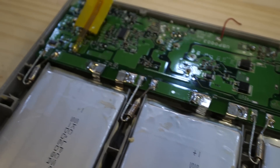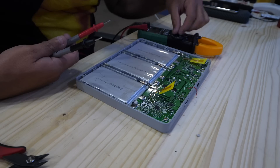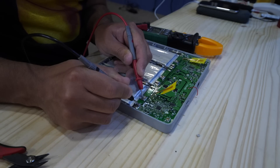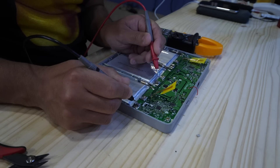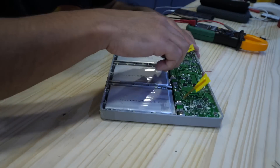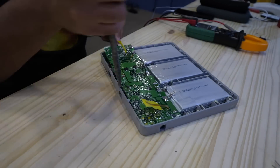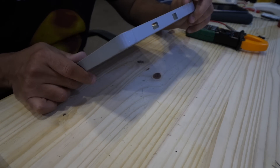At this point I decided there's not much useful stuff inside — there's a huge circuit board that doesn't do much more than adjust 11.1 volts to 20 volts and everything in between. Since it's bricked and I couldn't get it to work, I thought let's just take the cells out — unglue those LiPo cells and figure out how to use them. There's not much else to do but try and take these out of the case.